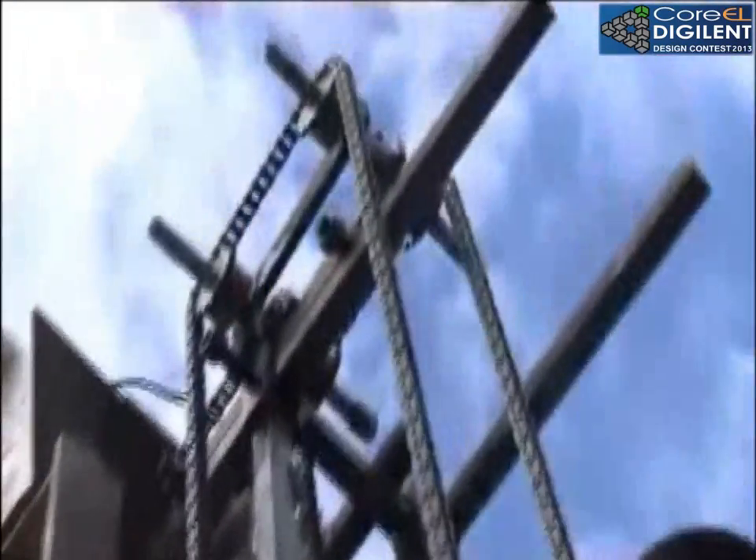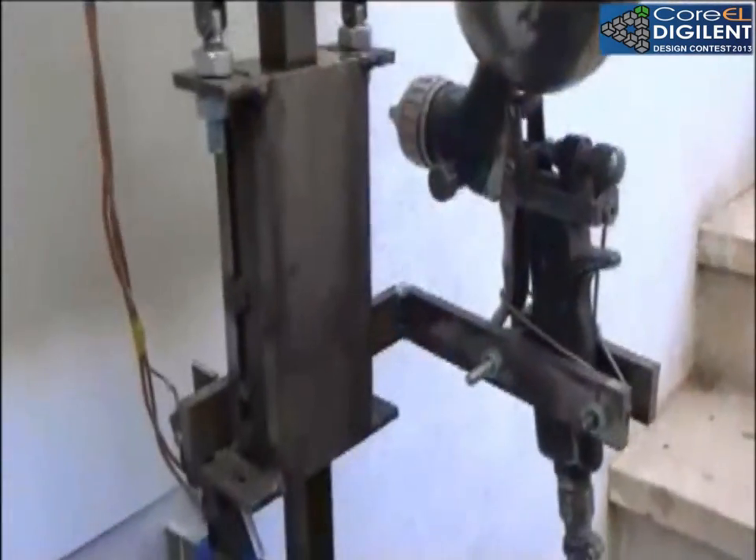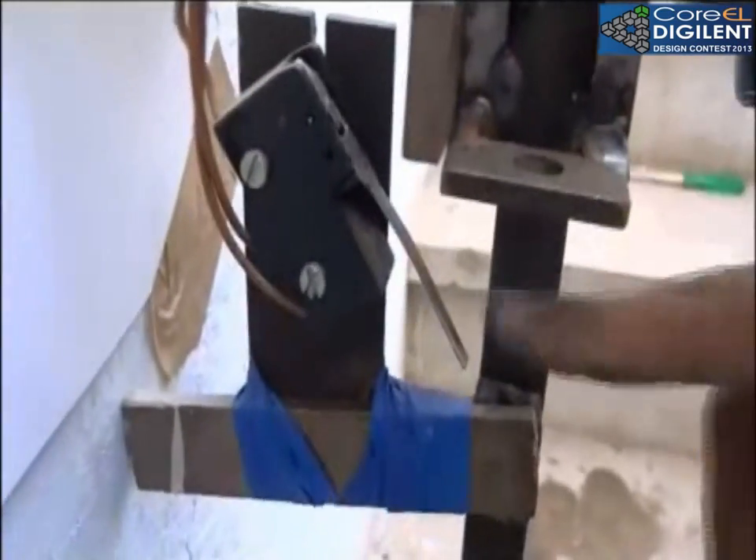Y movement will be guided by this rod and we have used this weight for balancing the weight of this spray gun and its movement, because it is a normal elevator lift assembly. It is a balancing weight which is hung free so that this will move without any disturbances or vibrations. Here is the lower limit switch — if the limit is reached here then the signal will go to the board.